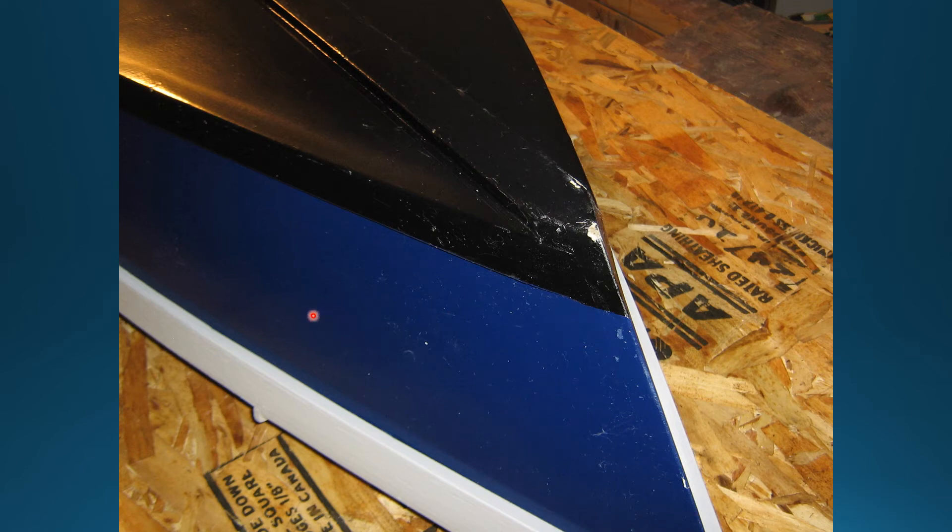Welcome! In this episode we will install the keel and the false stem. The keel is this longitudinal timber here. It protects the bottom of the boat and it increases both the strength and the stiffness of the bottom significantly. The false stem right up here, or the cutwater, is a vertical timber added to the bow of the boat and helps us to cut through the water. Let's get started putting these in.